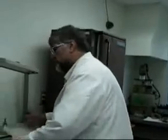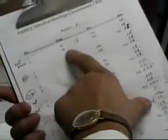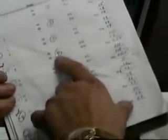how the watches run. Basically, we have a sheet, and we test the watches for 16 days. Now, on day 1, we run a temperature at 68 in the pendant up position. Day 2, 68 pendant right position. Day 3, 68 pendant left position. Day 4, 68 dial down. The 5th period is 68 dial up. 6th period is at 41 degrees, in the dial up position. And then on period 7 we switch to a temperature of 95 in the dial up, and the last period, 8, is 68 degrees, pendant up. Now we test these for 2 days in each period and then take an average.